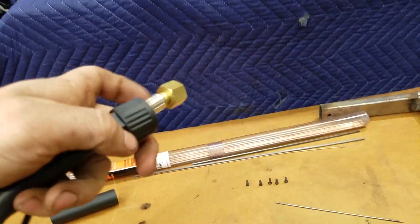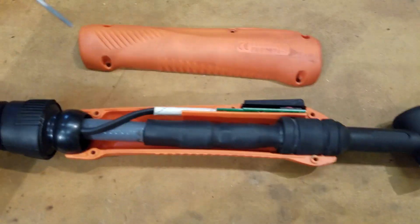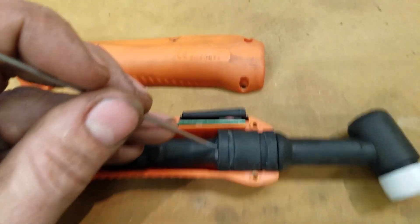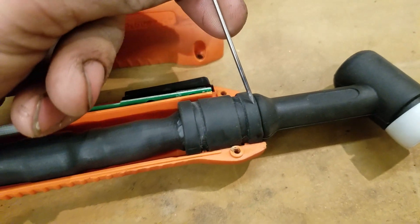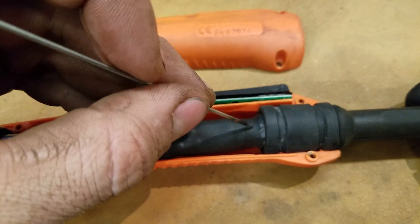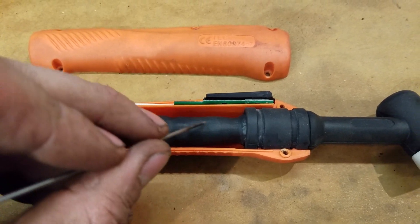You have to pull this end of the hose out. But first you need to disassemble your TIG torch - five screws. After your five screws, you pull this section out. This piece of rubber right here is not part of this. Slide this guy as far down as possible, then take your utility knife, pocket knife, or jackknife and score and slice this material to get it off.